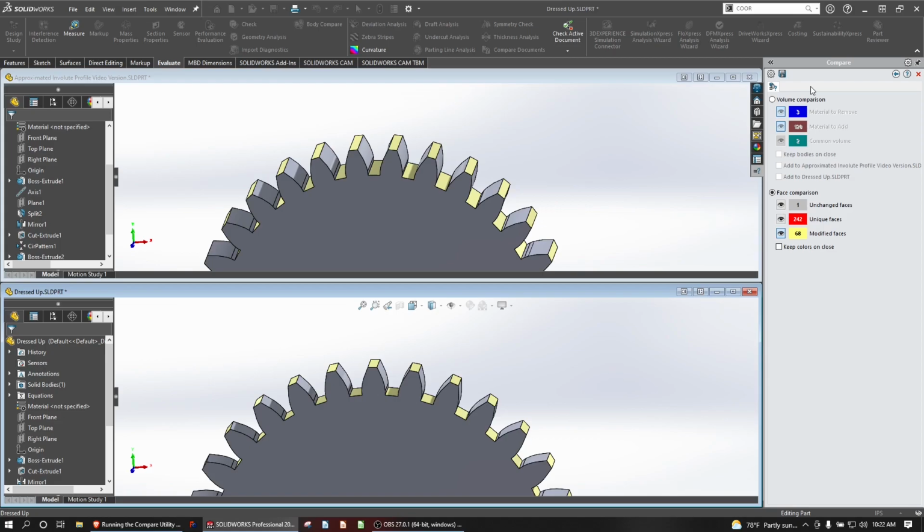And one other thing that's worth mentioning is, I think we've got some good evidence out of this video. I would say what I've done, though, is somewhat unscientific, as I've tested one gear. So you may want to, if you have the ability, test gears that are, say, 10 teeth and 35 teeth and, you know, a wide variety of these things, so that you can get a good idea as to if gear size and other parameters make a huge difference to the profile. Test different pressure angles, test different moduluses or diametral pitches. But I think the evidence here would show that most applications are probably pretty safe with this profile. Nonetheless, there may need to be some more detail in this.